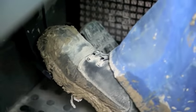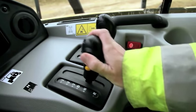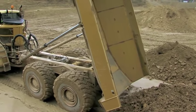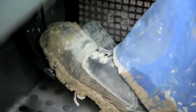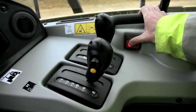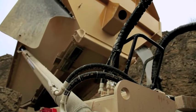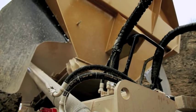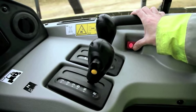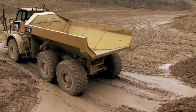Apply the service brake, disengage the park brake, select drive with gear selector, and pull forward slowly until the spoil clears the body. Apply the service brake, select neutral gear, engage the park brake. Lower the body and release the hoist lever into float when approximately 12 inches of the cylinders can be seen. Apply the service brake, disengage the park brake, select drive with gear selector, and pull away as normal.